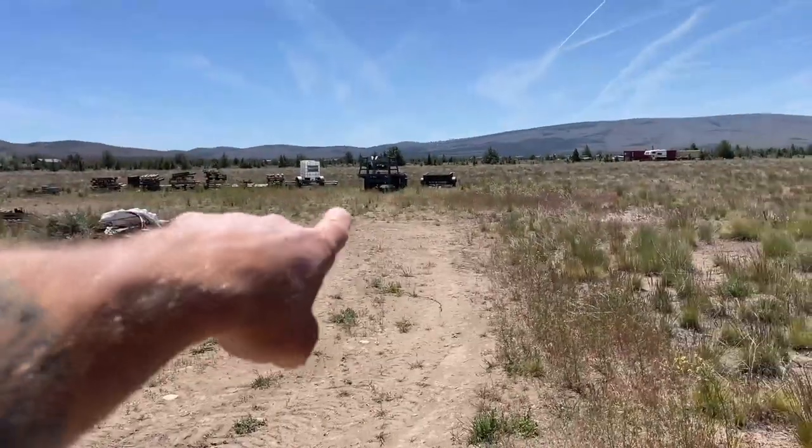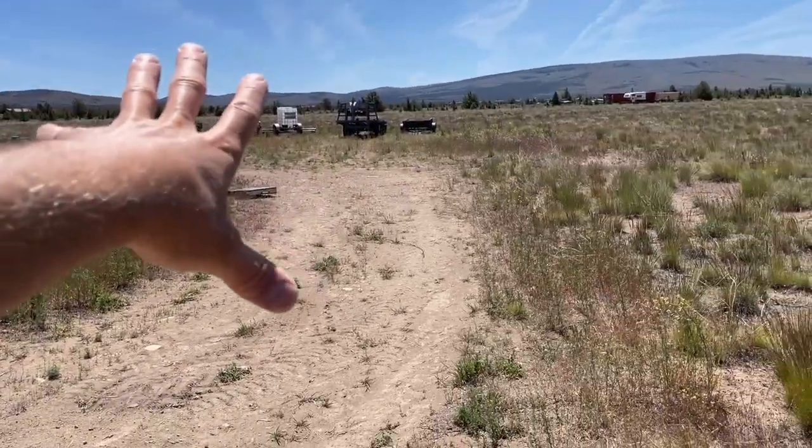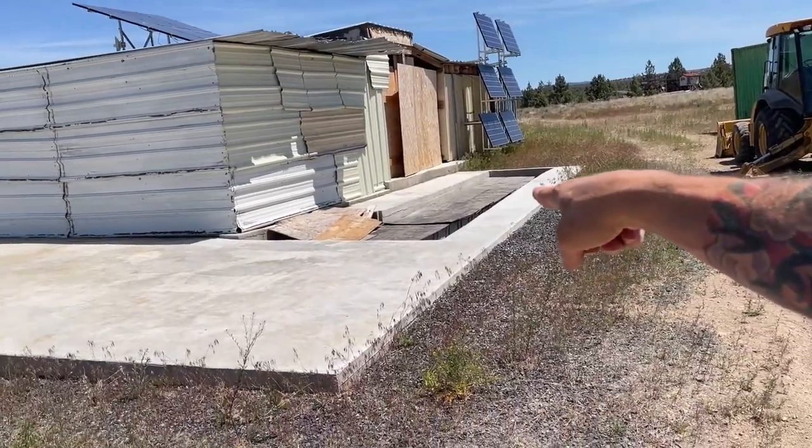The house goes here. And that I've actually evolved over the years as well. A lot of information on earthships and the problems they have. And so I was like, you know, use the principles. I didn't like the amount of plumbing indoors within the place, complicated technical plumbing to do all this filtration work, right? Which I'm doing with the sewage treatment plant that's right there. It's not exactly the same thing as theirs, but the end result is you're processing your own waste on site and utilizing the effluent to do stuff with it, right?